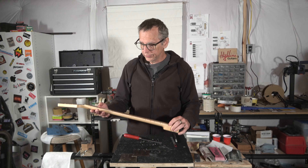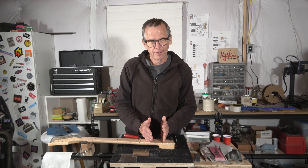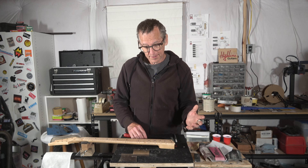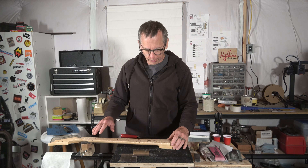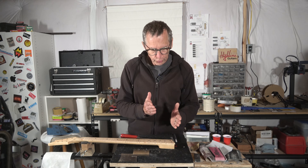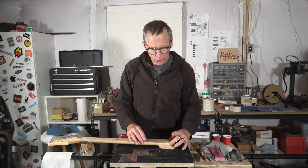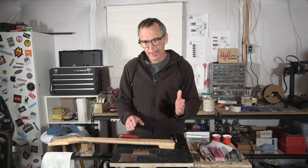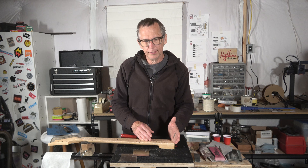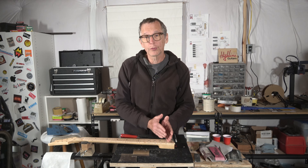That's all the time I've got for this video. I promise in the next video I'll be installing the frets — I ran into that little issue with the tool marks which delayed things a bit. In the next episode I'll show you the process for pressing in frets on a guitar neck that has a conical radius: 16 inch radius at one end and 10 inch radius at the other. And as you can see, it is also a multi-scale fan fret neck, which poses some interesting challenges.